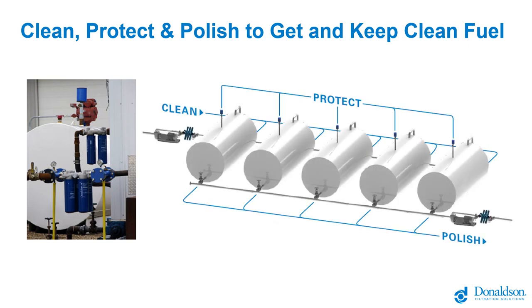The concept is the same for an even larger system — say a mine site or a large heavy-duty operation. You're getting fuel delivered in high volume via tanker truck, using the pump to push fuel into the tank farm and clean it at that point. Put breathers on all the tanks in the farm to protect them, then filtration on the way out as you're filling equipment. The concept is basically the same no matter how big or small the system.